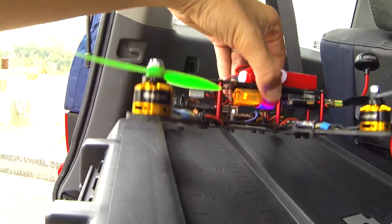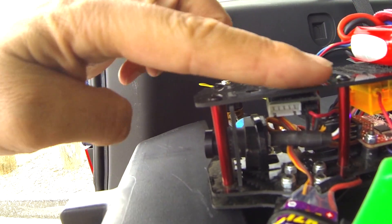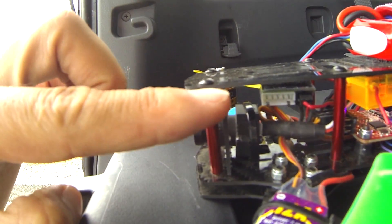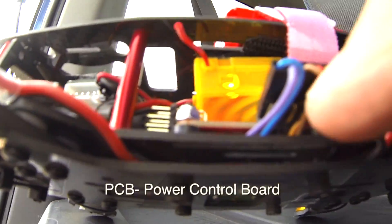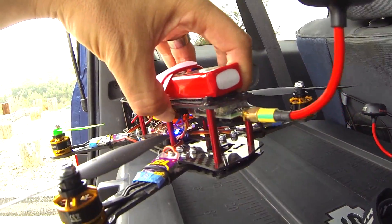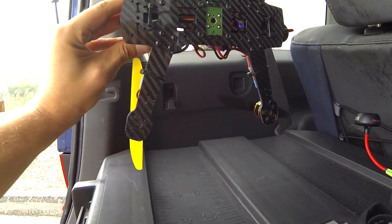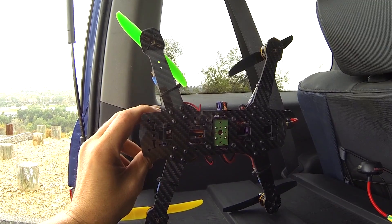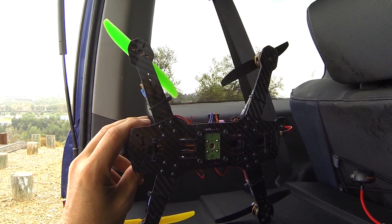As far as this frame goes, it's really nice but there are a couple of flaws. The little board piece of carbon here was too tall and was actually bending the carbon to get it to click in, so I had to mill off a little bit. The bolts come all the way up from the bottom through the PCB and main board, and the holes don't line up perfectly so the screws are canted off just slightly — the quality control is a little off. But this craft really does a great job flying. I don't have experience with other quads so I can't compare it to the QAV250, but my experience so far has been mind-blowing. I really love the way this thing flies.